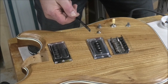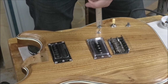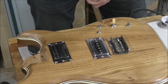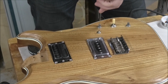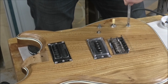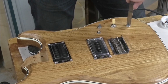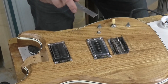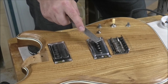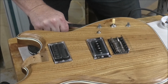Why would I tap that one? That's not on anyway. That's not good. What about the tone? Does that do anything? Yeah, the tone sounds like it's working, but the volume isn't. I'll have to inspect the wiring on the volume, and if it's not the wiring, I'll just have to replace the pot. Annoying! Okay, I'll have a look at that.